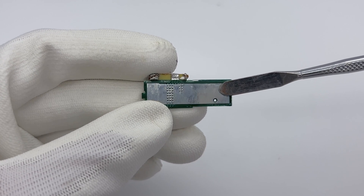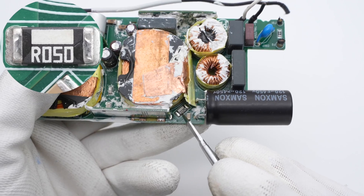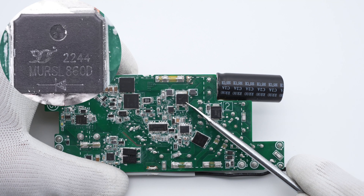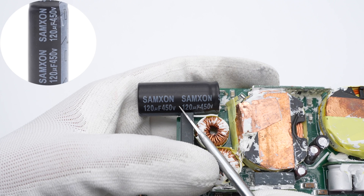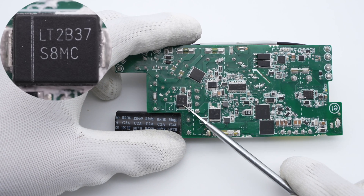There are many small holes for heat dissipation on the small PCB. The big PFC boost inductor is wrapped in copper foil. A 15mΩ resistor next to the inductor can detect the current of the PFC MOSFET. The PFC rectifier is from Yang Jie and adopts a TO252 package; it supports ultra-fast recovery, 600V, 8A. The electrolytic capacitor for input filtering is from Semoxon, 120μF, 450V. This bypass diode is used for the PFC circuit and pre-charges the electrolytic capacitor.